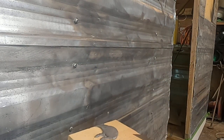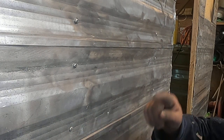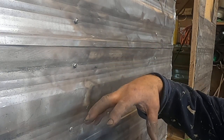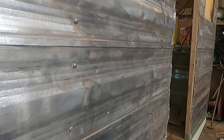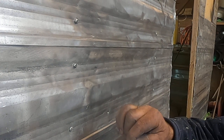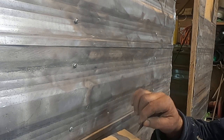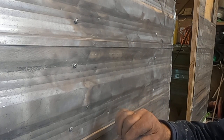Now once, when I was a kid back in the 70s, I was stupid enough to take a whole tube of hardener and put it into a whole container of body filler. It was probably a half hour later, it was hard as a rock. So do small increments. Remember, the more hardener you put in, the harder it gets and the less work time you're going to have. So my suggestion is to start small.